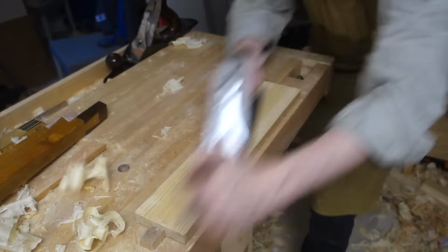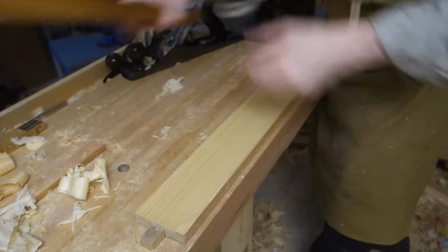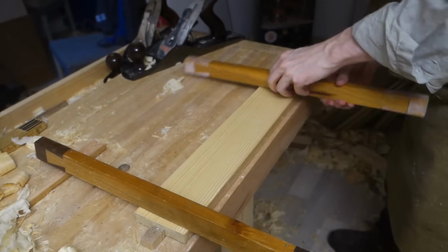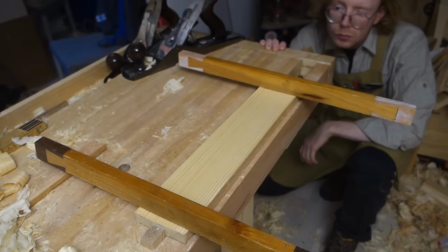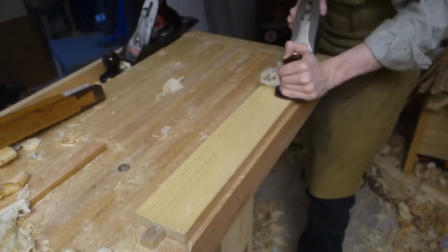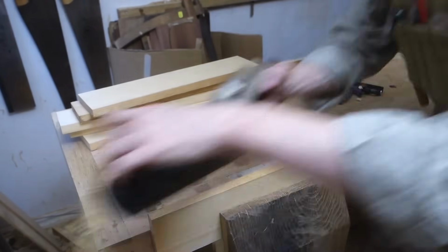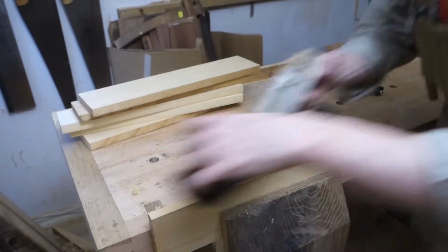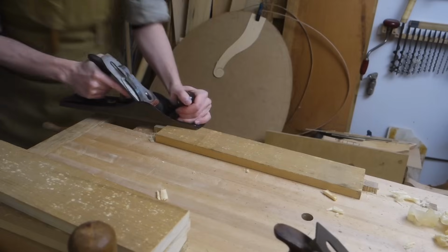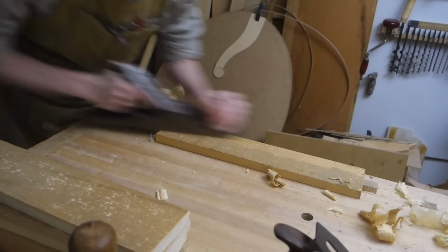The other half of the resawn board was cut up into narrower pieces that will form a mitered frame around 3 sides of the panels to stabilize the tabletops. These parts were flattened all the way around, creating a flat reference face, a square edge, and lastly a second face coplanar with the first. One edge was left rough for now.